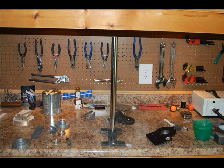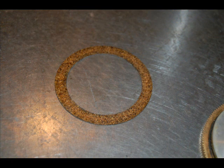This photo shows the declination shaft after about two hours of work on the lathe—it is now shiny. I took down the high spots with a file, being careful not to touch where the polar shaft bearing meets the declination shaft. I then polished and buffed it with successively finer grits from 150 all the way down to 4000. It is now ready for the saddle to be cleaned and repainted; I will tape the declination shaft to keep it clean.